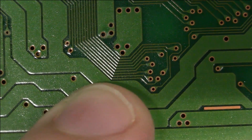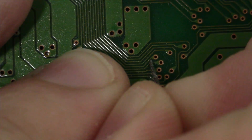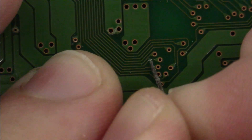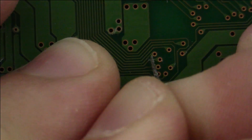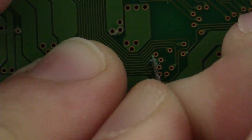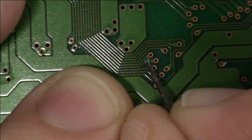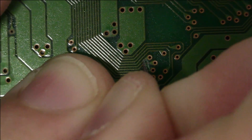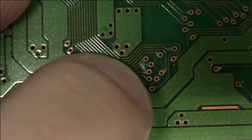There's the old girl, so we need to slice that trace down. When you're severing a trace on a board like this, the first pass you make is just making your track for your knife to follow through on the next run — you're not putting a lot of pressure down, just making a little groove. With every pass after you make your initial groove, you're going to put a little more pressure down. As you can see, we've got a pretty good slice here. I'm going to do a couple more passes for good measure, very gently.